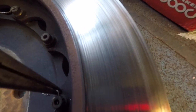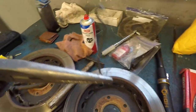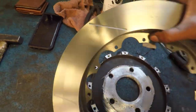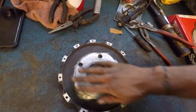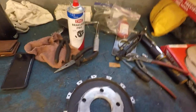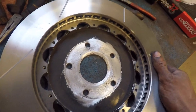This side already started to come out over here, so I can just pull that out now. I'm just going to twirl it like spaghetti — and got it out like that. Just a quick tip there because this stuff is pretty annoying. So got the new rotor here and the top hat. I went through and cleaned off any Loctite or residue from last time I put it together, just sanding that down. So I'm going to go ahead and place this on there, just line up the lines where they need to go.